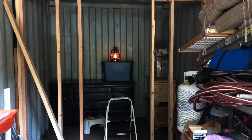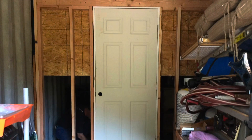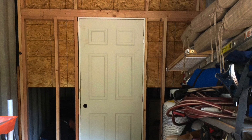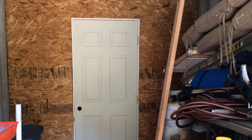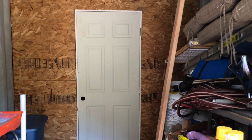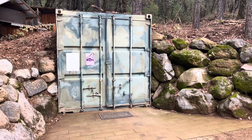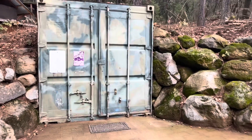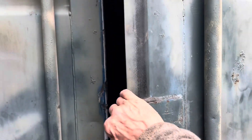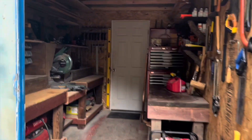The very next thing I did — and this thing was full of my stuff too, so I had to empty it out on a good day — I got in here and framed a wall at the back section, basically just put a bulkhead in. I insulated all these walls and got an insulated door, so the whole back of this container was insulated off on itself — it's eight by eight. The front became just a shop for me, where I put walls in.